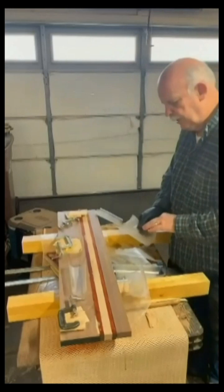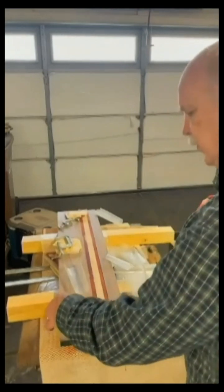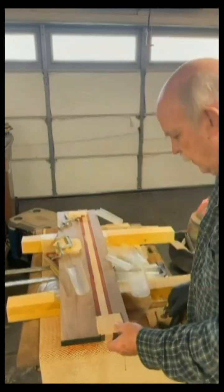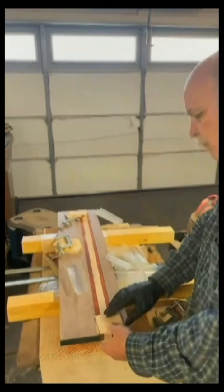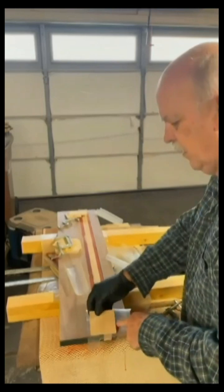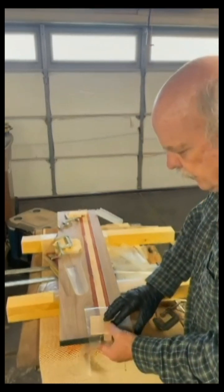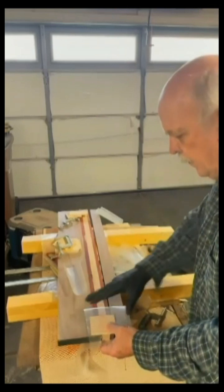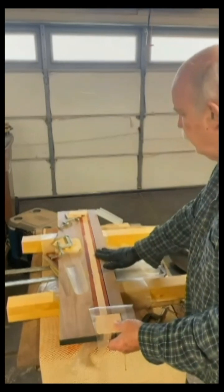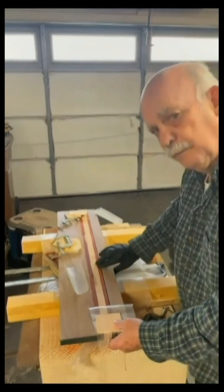To help save a lot of the glue cleanup, I take some wax paper in various sizes. On both ends as I'm getting ready to glue it up, I use a little piece of scrap wood underneath, then clamp it. Before I put the wood down I put the wax paper down — put that underneath, then put the clamp on and check that it's perfectly level on the bottom and top. Do the same thing for the middle and the end. If you find a high spot you can use that to make it perfectly level.